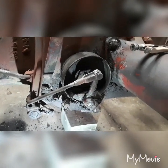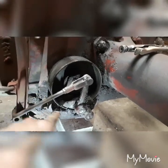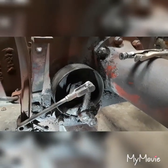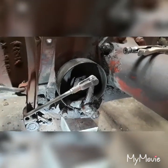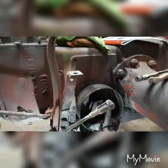The reason I'm tearing this all apart is you can probably see all the oil and grease there. There's a seal in here. Your brake shafts actually come out the side of your transmission and I didn't really notice it till after I started sandblasting. I want to get it fixed quick because I don't want this to start rusting again.